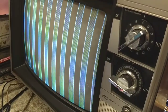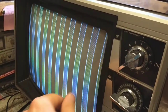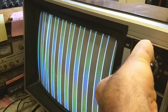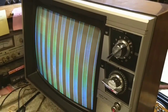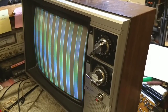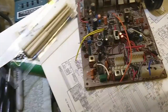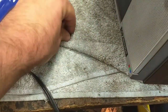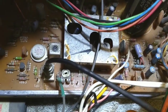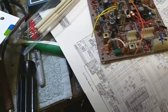That may also explain why there's such poor IF response — video response. You get all these lines of peaking and the IF is very tunable, so that concerns me. I'm going to go dig through my boxes of stuff and see if I can find a ferrite core to stick in there. I've got this old tuner board which I pulled one of these cores out of — I had a couple of other ferrite cores but they were just too large. So I've got the core sunk in there about halfway through its travel and I'm going to see if that makes any changes. I have my doubts, but at this point I'm willing to try.